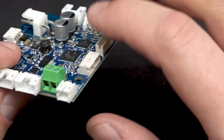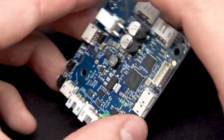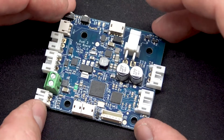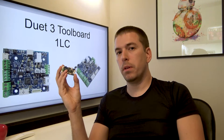It's a great addition and I am happy, but these upgrades I've done have made it more useful for me. I hope they come with an updated revision to make it even easier for hobbyists, because I do like the idea of bunching up all your cables into just two going back — usually you have to run four, five, or six cables and might need an extra large cable drag chain. That was a quick look at the Duet 3 tool board. A great companion especially if running a direct drive setup, and I think it will only get better in future revisions. Share your thoughts and comments below and I'll see you next time.